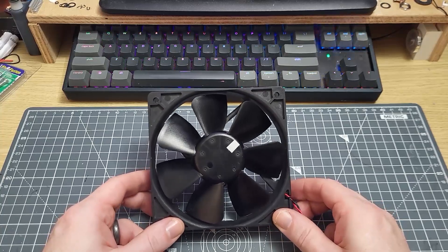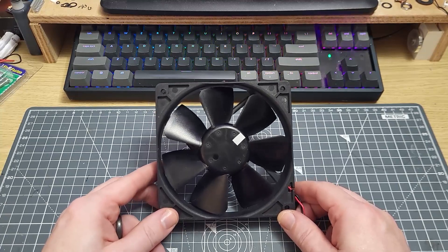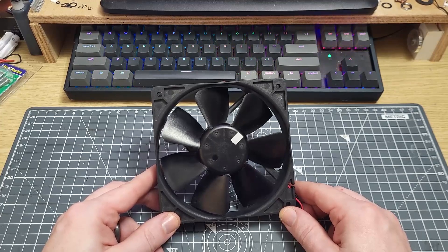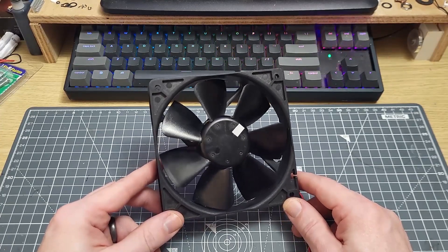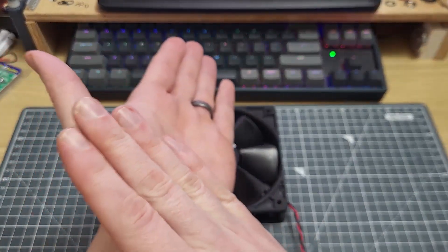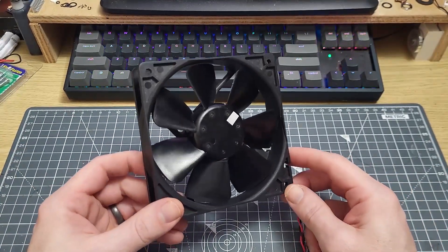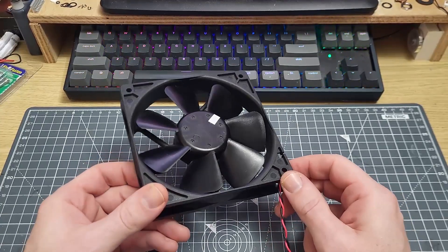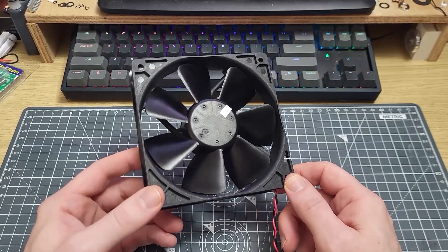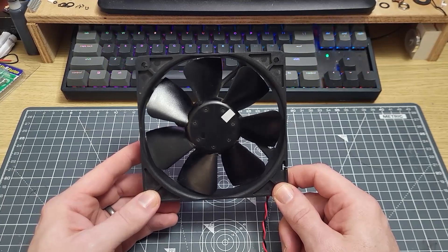I was going to talk about axial fans and I completely forgot my analogy, so here's my super helpful analogy. You've considered the golf club and the golfer; this time I want you to consider somebody swinging an axe to chop wood. It's a similar motion and a similar utensil in principle, but the mechanical force at play is entirely different. It's much more akin to what happens with an axial fan. The type of mechanical force I'm talking about is called a shear force, which is when two parallel bodies move in opposite directions from one another. The fan doesn't actually shear the air strictly speaking, because the blades are pitched and slightly twisted and there's an awful lot more going on from a fluid mechanics standpoint — but in principle this is much more of a wood chopper than a golfer, and in that sense it interacts with the air in an entirely different way.